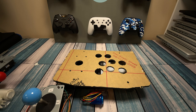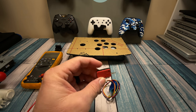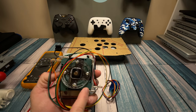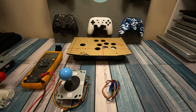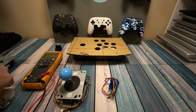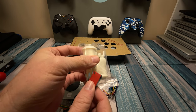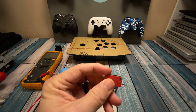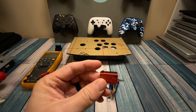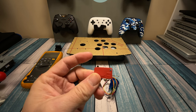Let's look at these switches and buttons. In this project, all of our joysticks and buttons are going to have some kind of switch built in. Some of them look exactly like this. You can see that these green things are just a different version of this particular switch. On this button here, there's a little micro-switch inside that you push. If you use the old HAP style push buttons, this actual thing would be attached on there and when you push the button, it would basically be pushing this little clicky button. These are the same type of micro-switches as in gaming keyboards — they always talk about cherry switches and what color they are. That's basically what's inside there, and that's what gives them that clicky sound.